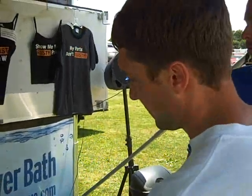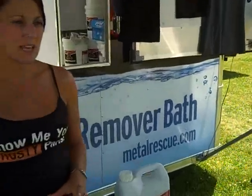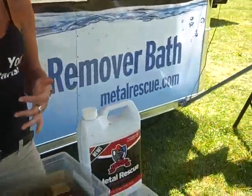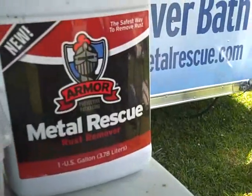You can see there's a tub over here that had a rotor sitting in it — so that's like used up there. Now if I was done for the day and all these parts were done, I'd take these out and all I have to do is really towel dry them. You can rinse them if you want, but you can just towel dry too. They are water-based, so you don't have to rinse off the water, you don't have to neutralize the surface, and you don't have to refinish the surface if you want to take these out and paint them — because it is water-based, there's no acid.